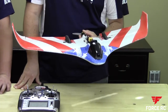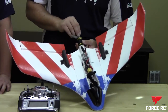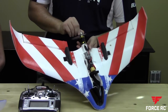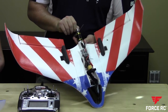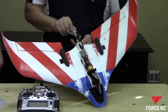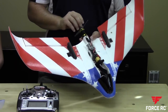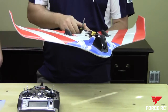Scorpion was really great — they got us a bunch of different motors to try. The first one I thought was going to be sweet ended up being way too hot, never would have made flight time or current, and it melted everything — melted the motor mounts. So we ended up at this setup. We tried probably 30 different props, a lot of speed tests, current testing, not really much static thrust because it unloads so much in the air. The biggest thing was we watched a lot of Nationals footage, checked how fast everybody else was going, did a lot of calculations to figure out how fast we needed to go, and mapped out the course multiple times on Google Maps. A lot of testing.